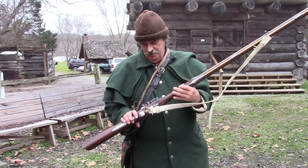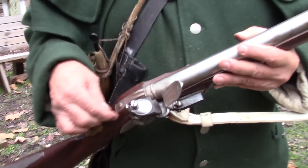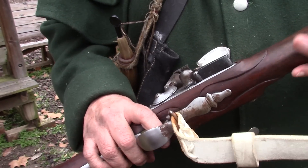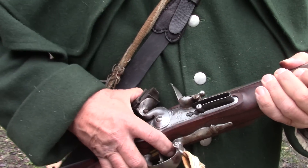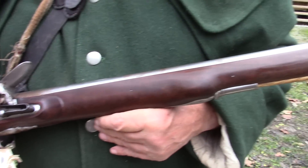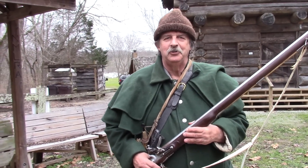Okay, there's Randy. This is sort of a Brown Bess built from rifle shop parts. The main thing keeping it from being a real Bess — I don't think it's got a true Bess barrel on it. The tang has got a very decided rear sight notch in it that would probably make it illegal for shooting most smoothbore matches because it's above the plane of the barrel. What caliber is this gun? This is a .75. What kind of lock is on that? It's a rifle shop lock — you can buy them assembled. This one was built by the guy that built it. It has a pretty good action to it, but there's a little bit more gap in the frizzen than I would like. The springs are all well tuned on it. Very, very heavy gun. My hat's off to the much smaller 18th century people that carried these things around. I'd like to try that after a while. We'll load her up and give you a shot. Thanks, Randy.